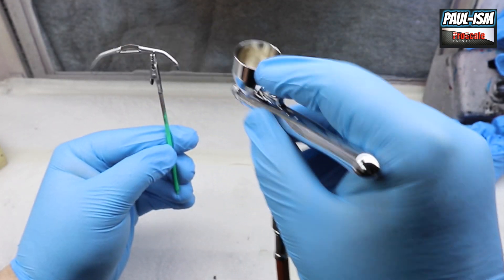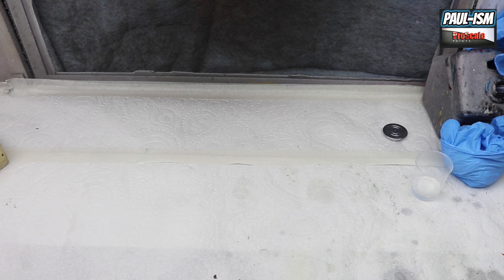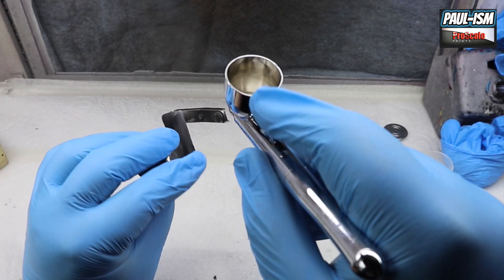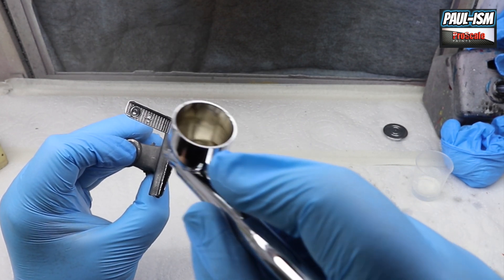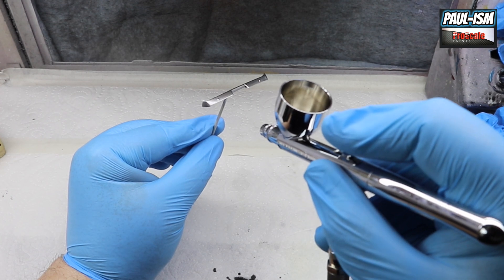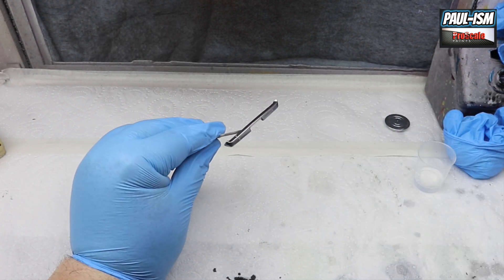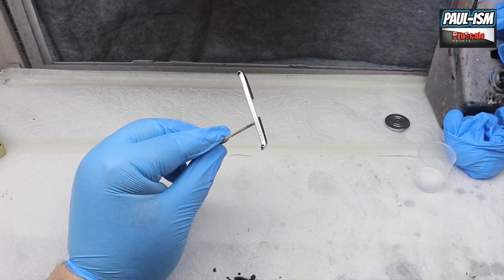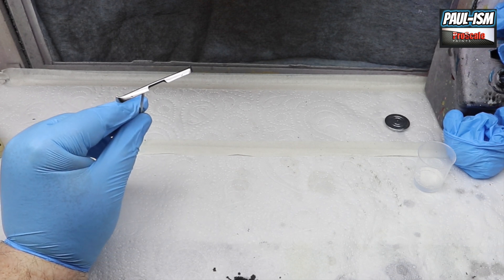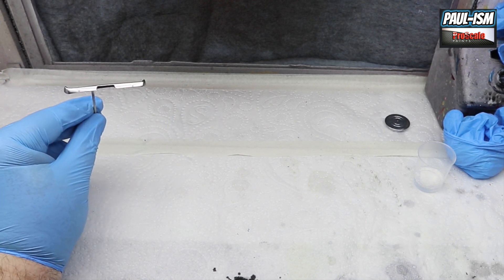We now have a beautiful high-chrome finish on our parts. I'm going through my Iwata Revolution 0.5 at about 24 PSI for the 2K. Make sure you follow all safety precautions: gloves, a proper respirator, spray booth running with ventilation, and be in the room on your own. I gave it a third coat and the shine looks absolutely fantastic. The 2K is super thin so it doesn't look overly thick, and it dries in about six hours. Once finished you can polish it up for even more shine — it will stand a lot of chemicals and you can handle it to your heart's content without losing any shine.